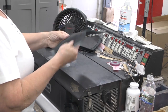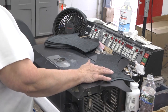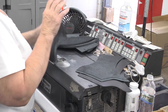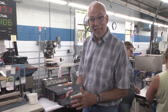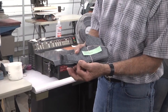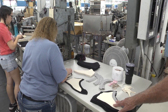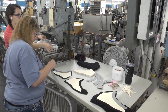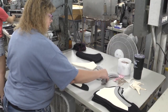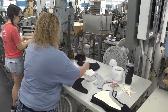There's a sharp knife here that's going to cut a bevel on the bottom of the lining and sometimes on the toe — different areas where we want to get a bevel because it's too thick and it'll shadow through on the outside of the shoe, or it makes it easier for the operators down the line by thinning out the edge. Here are some reinforcement pieces that go inside the boot. You can see this edge has been thinned out compared to the thickness of the material — so it doesn't shadow through to the outside of the boot. We're manning two reinforcements on: the white reinforcement makes the upper a little bit stiffer and takes out some of the stretch so it doesn't stretch too much. The gray reinforcement goes in the eye-stay area where we put eyelets and hooks, making it stronger so you can't pull them out.